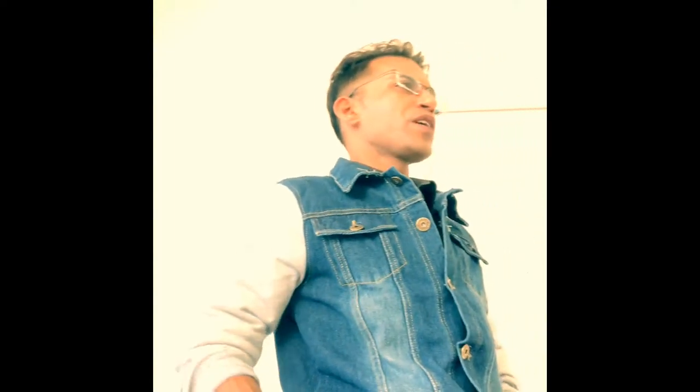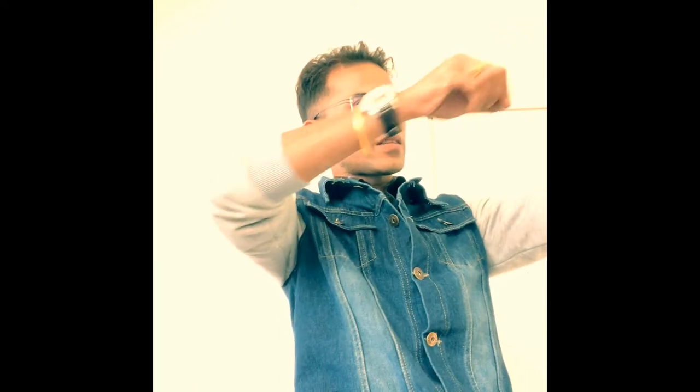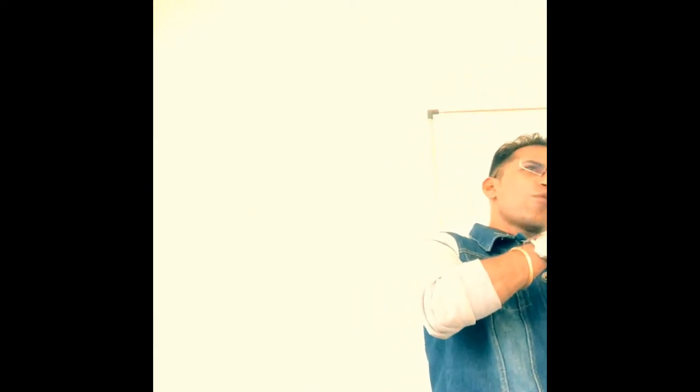Okay, the increment or the graduation marks are etched in the rule surface, providing a groove recess. This is done for a purpose: if the ruler does not have some groove in it, there is a possibility that your pencil, or scriber if you're using one, can slip off. In order to prevent that, we keep some groove so that it does not slip off and you get the correct reading. So we have some recess or grooves to ensure that correct reading takes place.